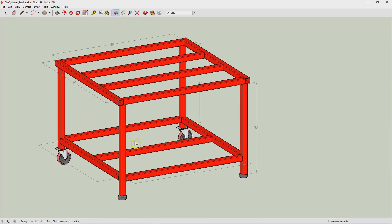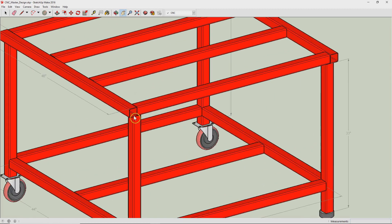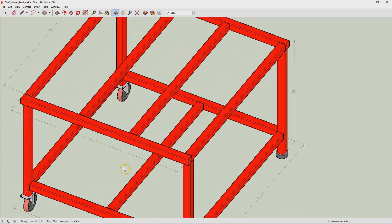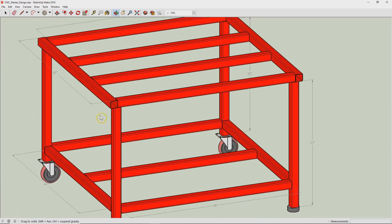This is basically the design I put together. I decided to use square tubing. Another option is to use 80-20 extrusion to make the base, but at least for me I found that to be pretty expensive, because I can't get the volume discount for buying 80-20 that other institutions can. So I decided to make mine out of hot rolled square tubing.